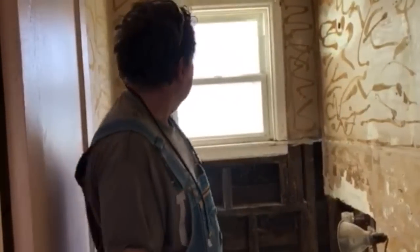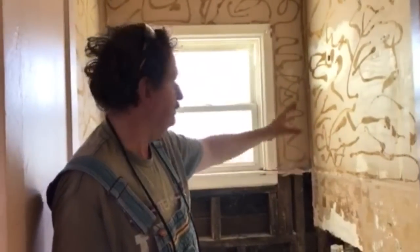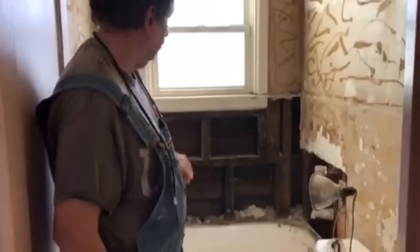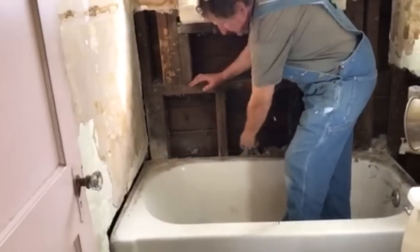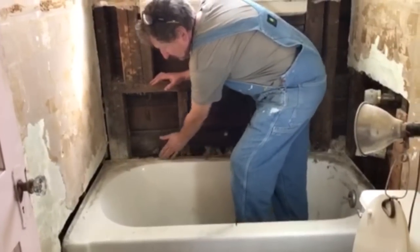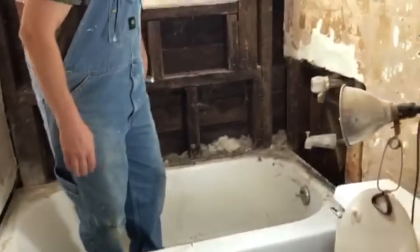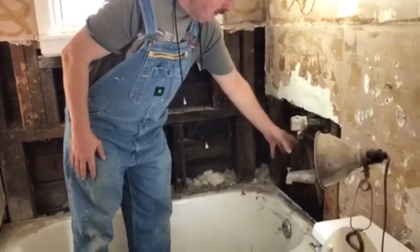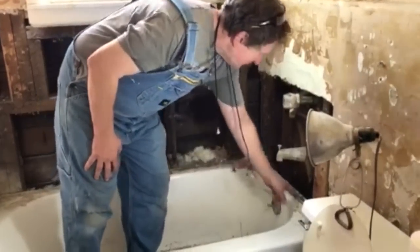First thing is we took out that plastic stuff glued up to the walls and surrounds, so we had to take it all down. The drywall — you're going to have to take some of it out. These bathtubs are generally drywalled right up to here; this is all you need to take out, about that much. The plumbing you don't necessarily have to take out, but it needs to be exposed all the way around.